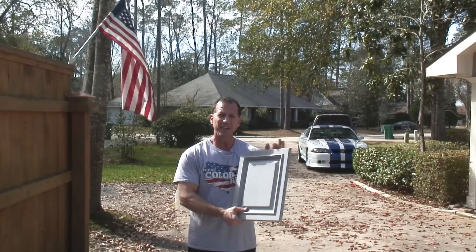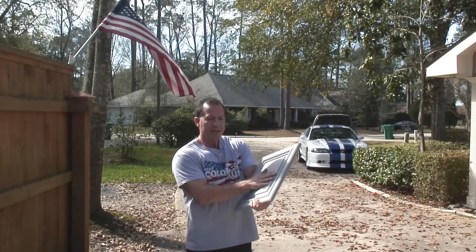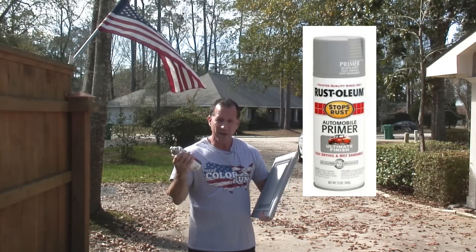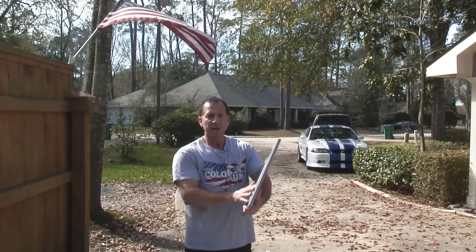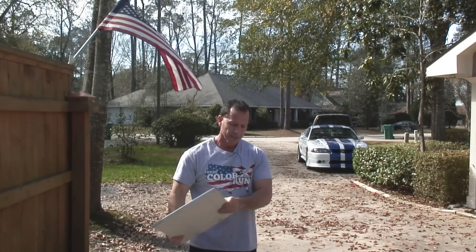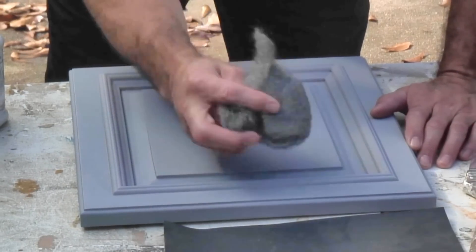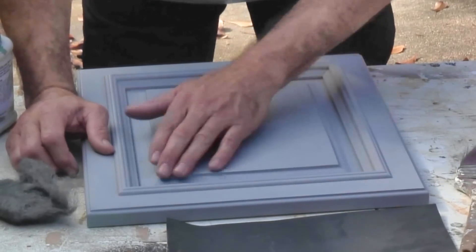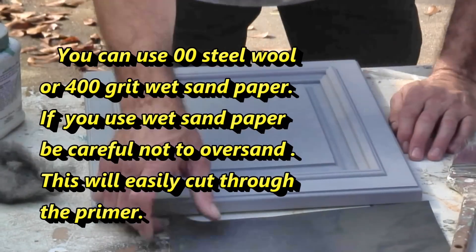I showed how to prep the cabinets in the last video — how to paint cabinets the easy way. After I prepped it, I came back and primed it with a can primer. This right here is an automotive primer, and I speak about that on the other video. All I did was spray it across the whole thing and let it dry. After priming the door, I came back over and hit it with double zero steel wool. I just come by and lightly rub it. After that, you need to clean it — blow all the little bristles off because they do break off in there.